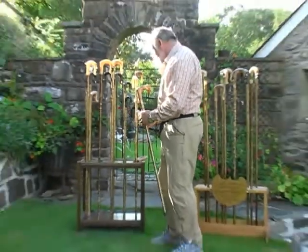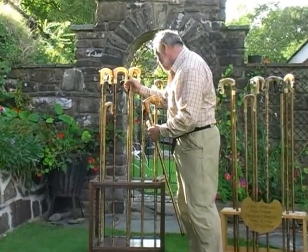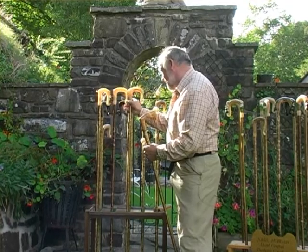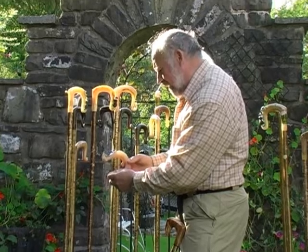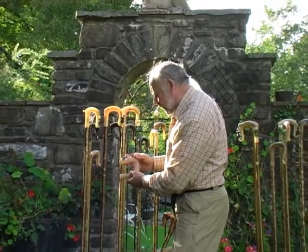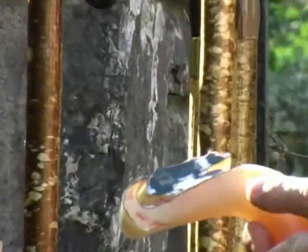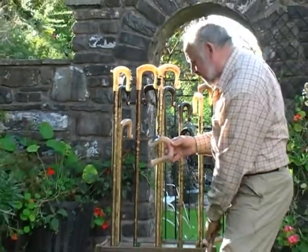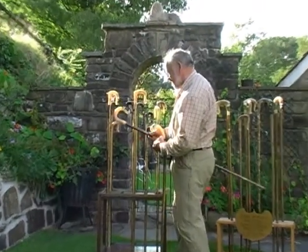Coming back again to the carving of the dog itself — the carving takes the best part of a day by the time I finish. So it's quite labour intensive. Just to make sure that the outline and stance is right, I cut that out from photographs, and then a piece of paper duplicated from the photographs so that each and every dog more or less has the same stance, unless for some specific reason I want to change them. I stick that piece of paper on the side, then I go with a bandsaw to cut out the outline just to get the shape.